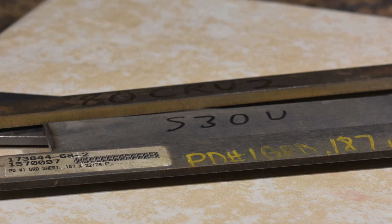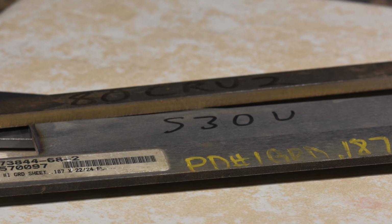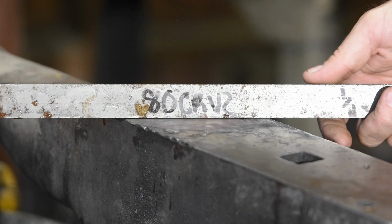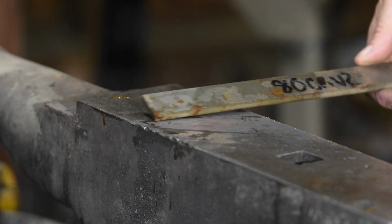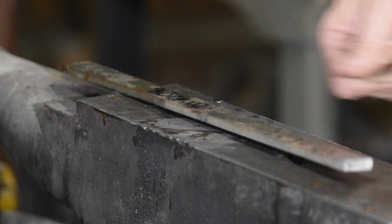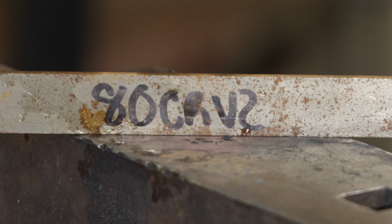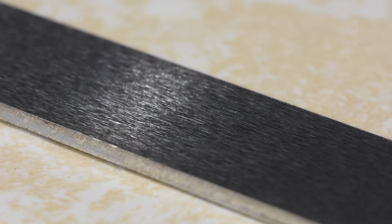All right, so let's get down to brass tacks and actually talk about how to make things flat. Now, the first approach, and I'm really not being funny here, is to just buy it flat in the first place. For instance, steel is generally sold in several different conditions, one of which is straight from the mill, which means you get scale, pitting, irregular surfaces, imprecise thicknesses, potential warping and twisting, just a lot of reasons not to buy it that way, but you can also buy steel in precision ground form.